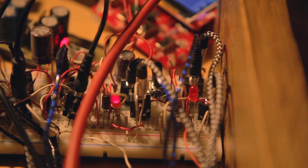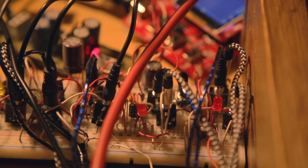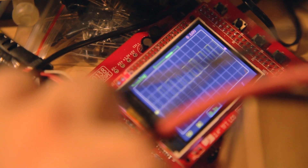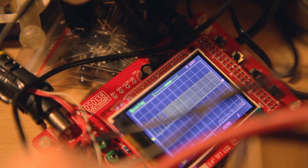While the last oscillator has a variable space-mark ratio, and we can adjust it with a little knob here. So you can see now the mark is smaller, now it's bigger. I have this hooked up to my oscilloscope so we can see it. This is a smaller mark — this is the bigger one. I don't know if it's really possible to see it in the video because the frequency is pretty high. So like this is smaller and bigger, and we can see it in the LED flashing.